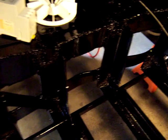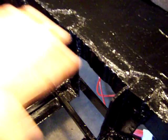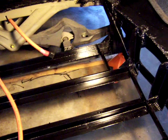Here are the battery boxes — I built several supports. I built this support and that support to reduce the risk that the rack will break under braking and acceleration, because that's when the most stress is applied. The racks and batteries are hanging from these two main supports, so I wanted to make sure they were properly supported and would not crack on a curb or under braking. I have several corner supports like this one. The batteries are ready and painted as well.